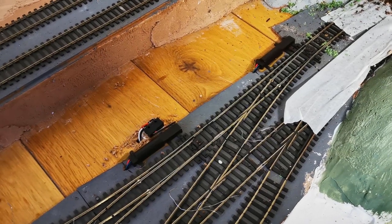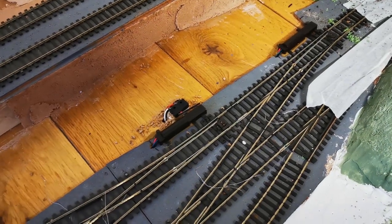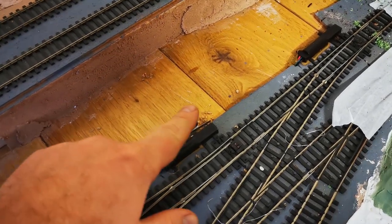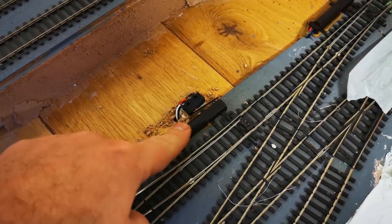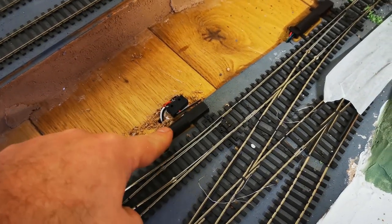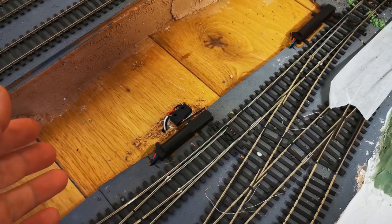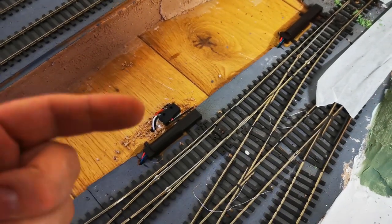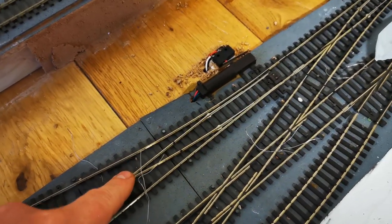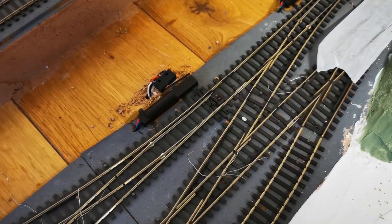For me, I'm going to be giving up on these and turning back to the servos. I've managed to burn one out through the practice of the coding, and I'm finding they're not being reliable at changing over the turnout when operated. For about every 10 times you operate it, the relay operates and holds on for 0.5 of a second but the turnout doesn't actually turn over. That one in ten is enough to cause derailing, and if my Arduino is doing the feedback to change the polarity of the live points, it also causes a short every time the train goes across the circuit.